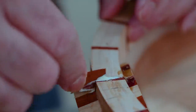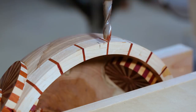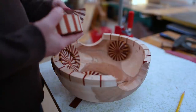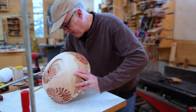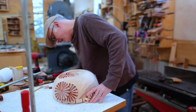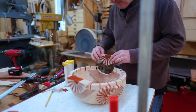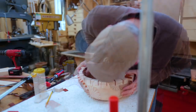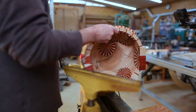I can glue that second insert in place. While cutting these holes, my rim piece opened up, so I made a little tiny shim to fit into that split and glued it in place. For the two inserts on the rim, I thought about clamping the whole bowl down, but wasn't sure they were exactly lined up on the seam, so to be safe I glued them in place and just held them for a minute or two while the glue set up — and that seemed to work. It's ready for final turning.